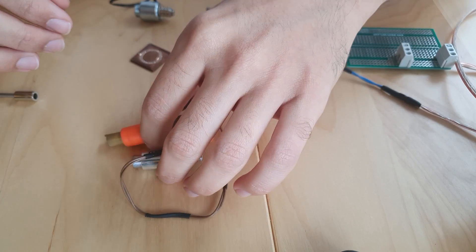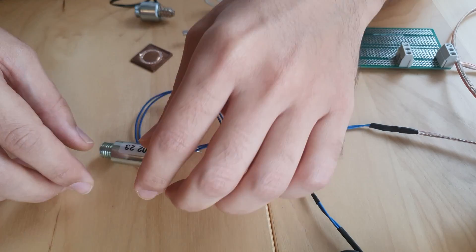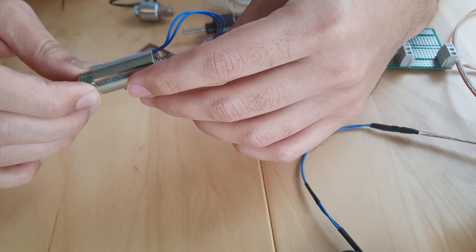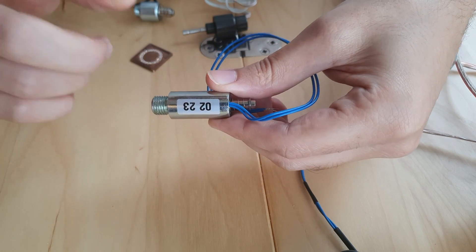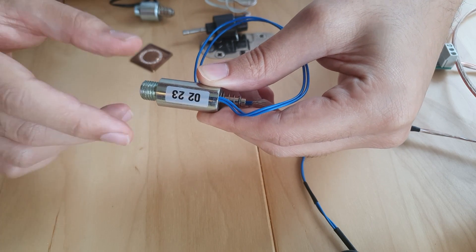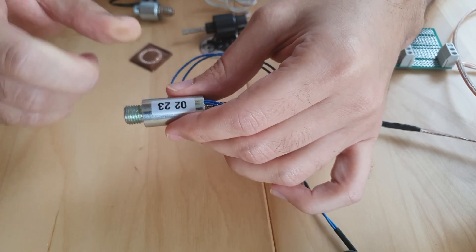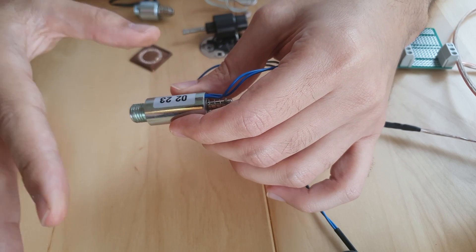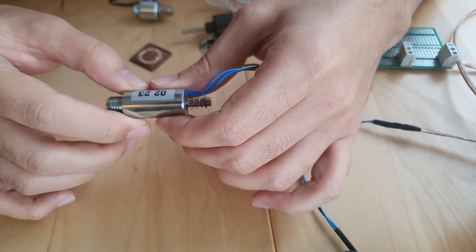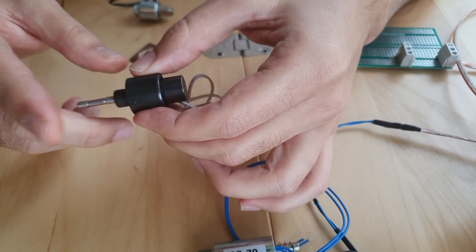For those who have a bigger hand or want more power, this one is a beast — it's a 12-volt version and it doesn't get hot. If I wanted to make an engraver, this would be the best one. I ran the machine at a higher frequency and at least 20% duty cycle to measure the temperature. This one went 35 minutes at around 60–65°C, powered at 12 volts through a 19-volt PSU.